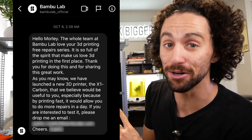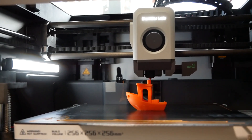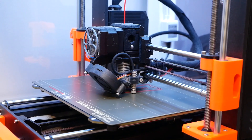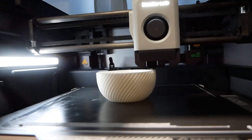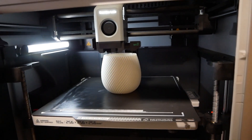Any opinions I share are entirely my own. So why is there so much hype around this printer? It's a Core XY 3D printer, meaning that the extruder moves in both the X and Y directions. Compare that with a Cartesian printer where the Y movement comes from the bed moving forwards and backwards. That Core XY movement, plus a lot of other features and engineering, allow this thing to print super fast. But it's not just the high-speed printing — as far as I can tell, this thing has almost every feature you could ever want.